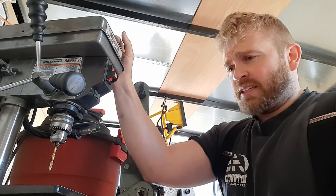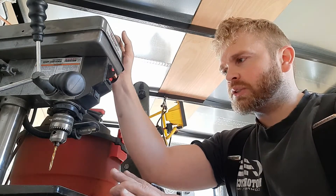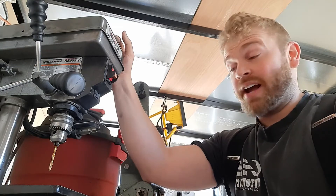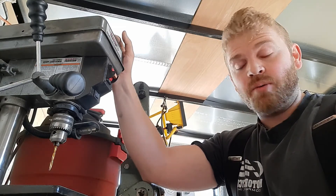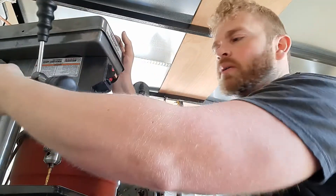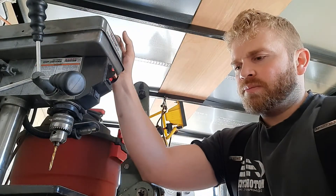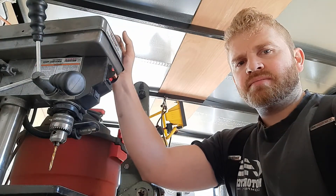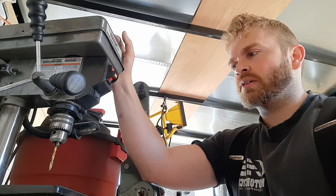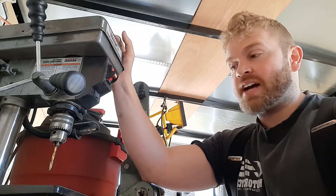The sharpness of the drill bit makes a big difference, but my experience with this drill hasn't left me with any regrets. I'm very happy I made the purchase because I'm a lot more safe now with drilling. It is kind of a short range of motion — I think you only have about two inches that the press itself can move — so you're not going to put something like a knife handle in there and go all the way through in one motion. You'll have to drill through it, pull the handle out, flip it over, and drill from the other end. But it's not a big deal to me — it's actually a little bit easier than the old method I used to use.